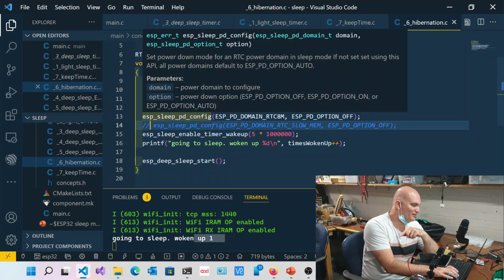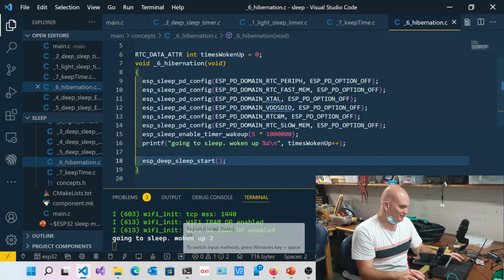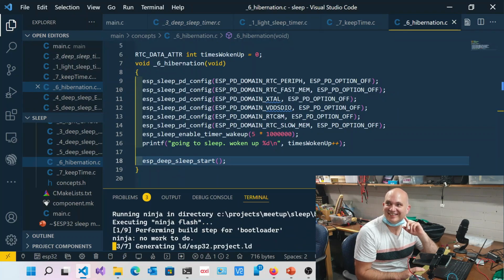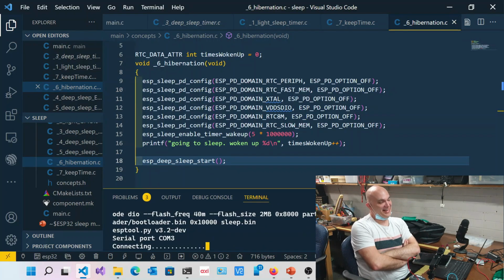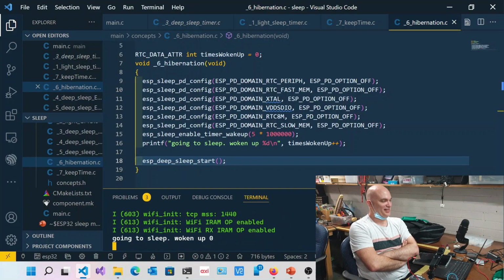So if we basically get rid of this one, we say we don't want slow memory anymore. Let's see what happens then. Counter variable doesn't count. We'll see. Well, yeah, look, it does what you typically would expect in C. And you'll see what I mean by that in just a moment. In other words, some crazy number. You get the first one looks okay, and then all of a sudden you get total rubbish.